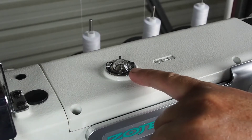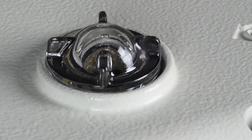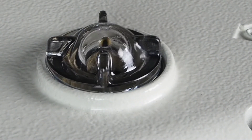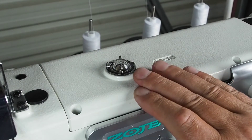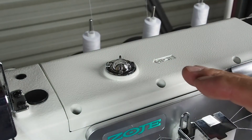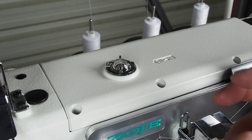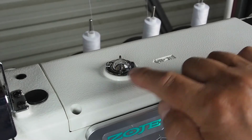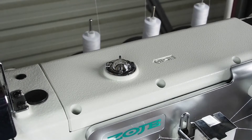You can see the oil pumping there. This sight glass here is a little bit like an oil light on a car — if there's a problem with the oil system, the oil light comes on to tell you there's low pressure. This is a similar thing; it's just a sight glass for you to check oil pressure.